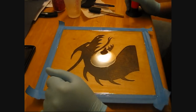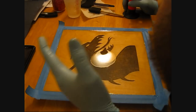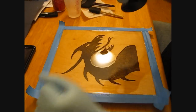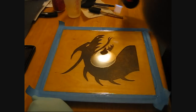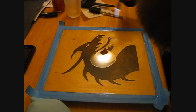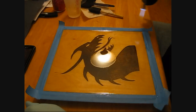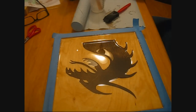I don't have a heat gun or a hair dryer, but another method I found to get rid of bubbles once you spread this out is a little butane torch. You want to be careful with it because you don't want it to scorch anything. It does a pretty good job of popping out any bubbles that might be in there - it's pretty quick too. You don't want to hold it still because you don't want to burn this stuff. Give that a day to dry and see how it looks tomorrow.